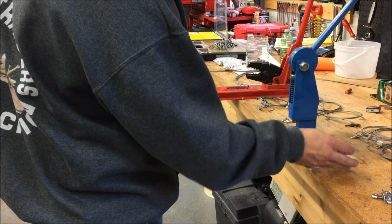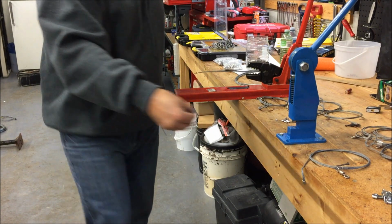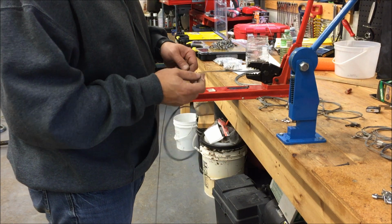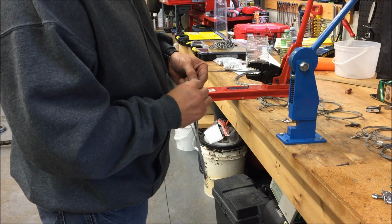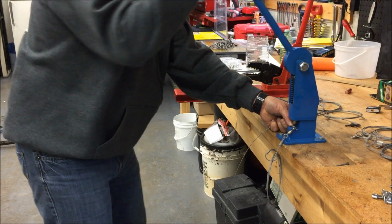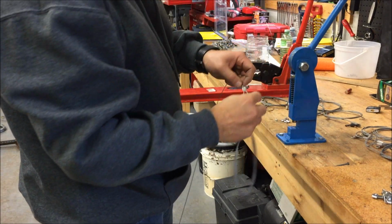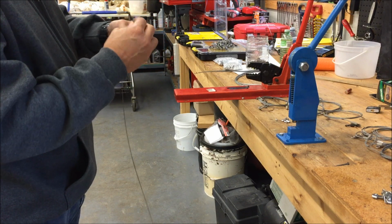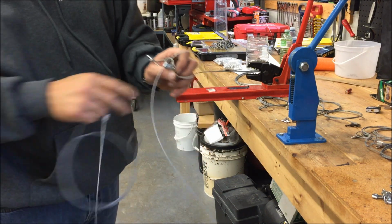And we'll come here, grab one of these used cables with a barrel. I'm gonna grab a couple ferrules. Put your ferrule on. Go through your swivel eye. Pull that up. You can pull it right tight if you want. Like a little bit of a play, so when I'm hanging it, it doesn't bind. And there we go. So now you have your loop. Like that.